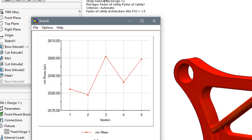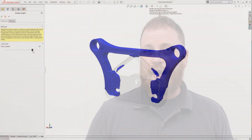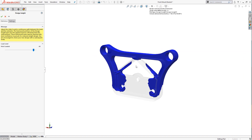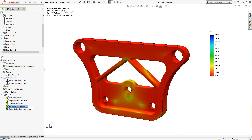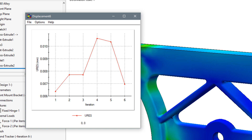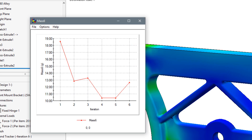It may need to refocus our design effort, but we're not beaten yet. Reviewing a design insight plot — where structurally important areas are dark blue — we see that the upper region is dissipating the energy of the load, a key piece of information that can only be provided by simulation. Adding geometry to the top of the mount resolves our issue. Viewing our trend plots, we can see the mass increase slightly, but the stress and displacement decrease. We also meet our minimum factor of safety of two. We've met our goals regarding stress, factor of safety, and displacement, but durability is still unanswered.